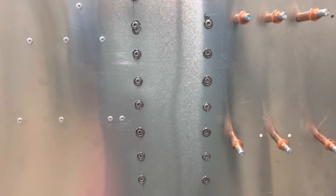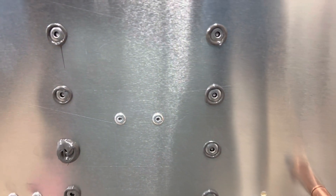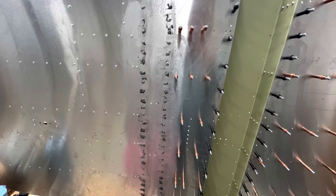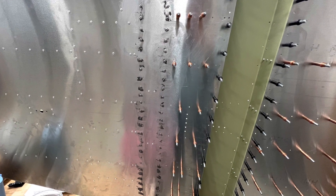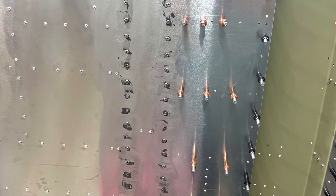I think we'll have some good corrosion resistance for years to come. Because I used it generously, I got a lot of squeeze-out from really pushing it into the cavity and into the spar carry-through, so I had a lot of cleanup to do. I first wiped it off with disposable shop towels, which really just made a mess, but it did thin it out so that when I went back with some MEK later it wasn't so thick, and I was able to wash it off.